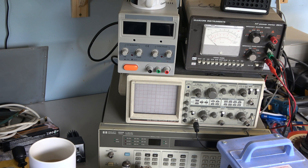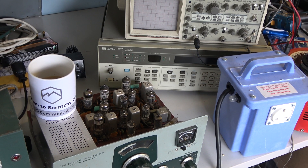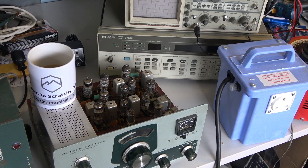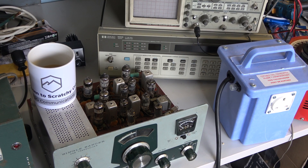It has to be the 893C, not the A, because that is indeed just an AF power meter. So back to the thing — the whole idea is that we've been using the HW12A successfully since we set it up as the manual said. But of course Heathkits were kind of there to help people who didn't have bucket loads of test equipment and didn't do this for a living, so they had probably a simpler way of setting up. But because we've got the test equipment, I think we can do better than what the manual says.